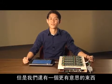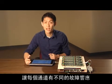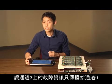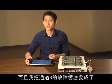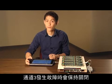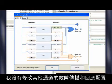But let's have a little more fun. We can easily reprogram the LTC-2978 to have a different fault response on each channel. Here, I have changed the configuration so that a fault on channel 3 only propagates to channel 0. I've also modified channel 3's fault response to not retry a power-on sequence when an under-voltage fault is detected. Channel 3 will fault off and stay off, and it will bring channel 0 along with it. I've not modified the fault propagation or response of the other channels.